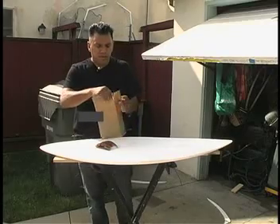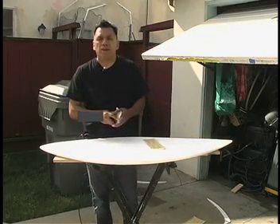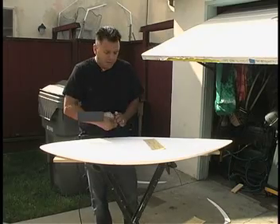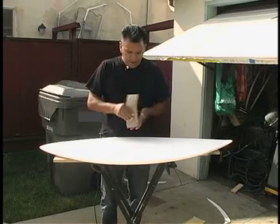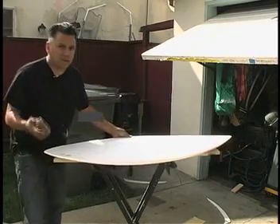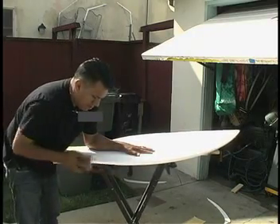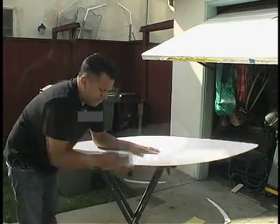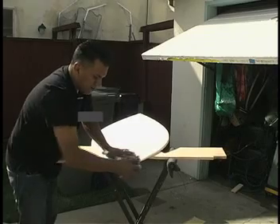What I'm doing is changing my rough-out paper to a 60 grit. 60 grit will allow me to take down some of the rough spots a lot quicker than a 100 grit. Wrap up your 60 grit on your sanding block and you're ready to go. Once I've got my basic shape, I'm going to take the tail down - a little bit fatter, a little bit wider.